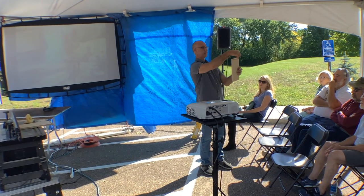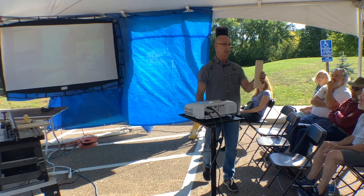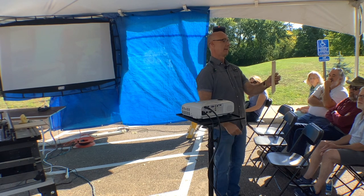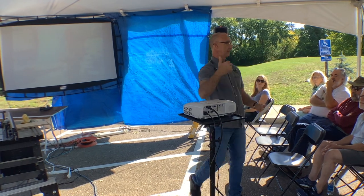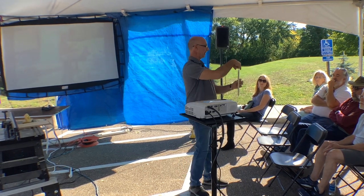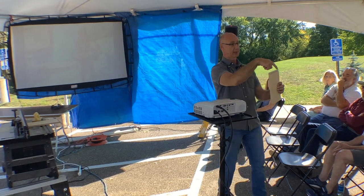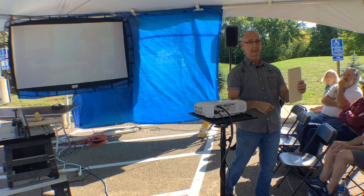This goes back to that old zero clearancing the fence idea. Baltic birch is a very chippy material. So if you're getting this, if you zero clearance the infeed side, this will go away completely. You won't have any chipping. So this is an occasion where I would do that.